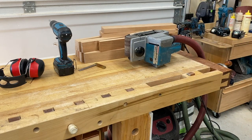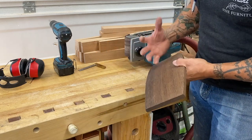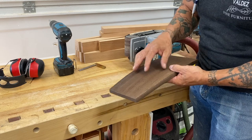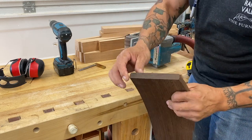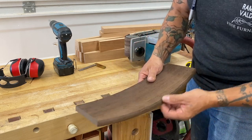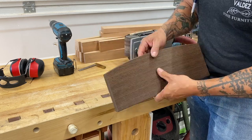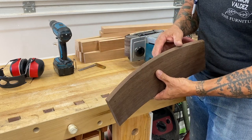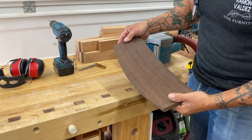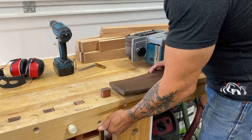Check this out — this crest rail or chair back is actually made of plywood bent in a form and then glued to create this curve. I added some end-grain solid wenge on the ends, a strip here and one at the top, and covered this with veneer. This has been sanded quite a few times and is probably getting pretty thin — I made this for a Furniture and Cabinet Making magazine article years ago just to show this process. But we're going to sand this again just to show you how awesome a belt sander is.